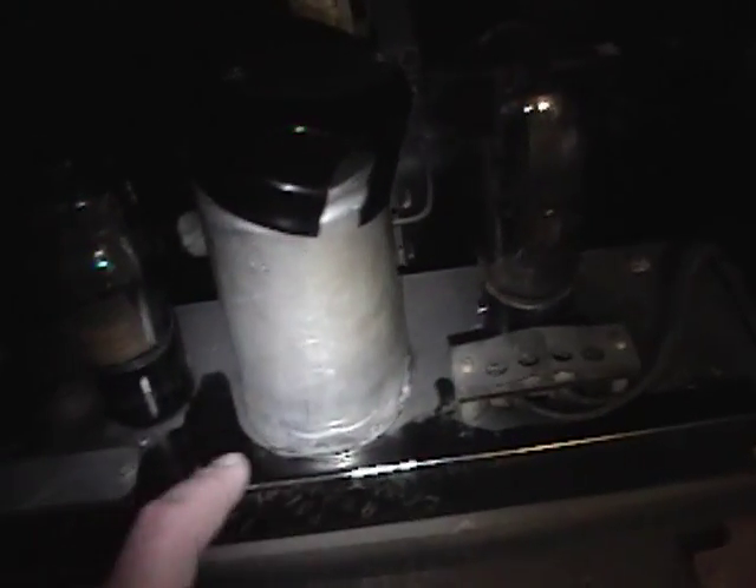I haven't taken this out in a while — it's kind of dusty — but this chassis is steel, painted with black enamel. I went over it with some car wax when I first got it, so underneath the dust it's in pretty good condition. Here's the label: Spartan Power Converter. The radio itself is on several chassis — there's the power converter, which is the power supply and output amplifier, and then there's this intermediate frequency chassis — though this really doesn't have a traditional IF. It's kind of like a tuned radio, but that's not quite right either. And this is the pre-selector.